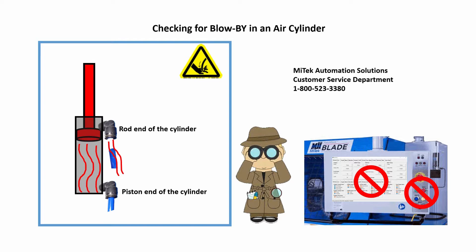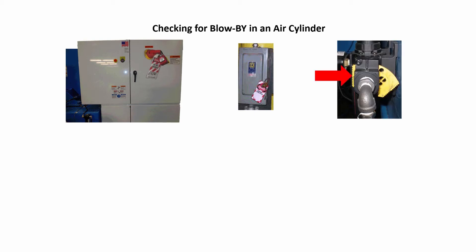If replacing or repairing and installing the cylinder, follow these steps. Do a proper lockout-tagout procedure on the machine's main disconnect switch. Next, locate the panel or disconnect in the plant that supplies power to the machine and do a proper lockout-tagout procedure on it. This photo is just an example of a disconnect. Push in on the yellow lockout slide lever on the main air pressure regulator on the machine and do a lockout-tagout procedure on the lever to prevent pneumatic parts from moving.